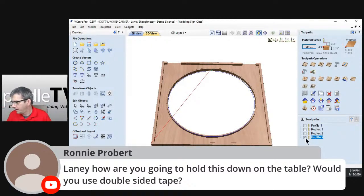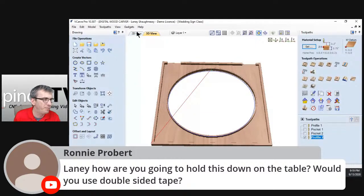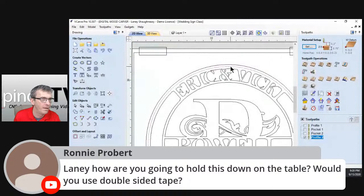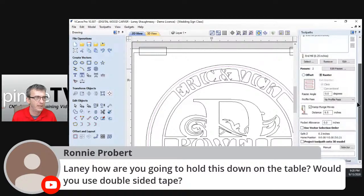And sorry about that. So let's really quickly regroup on that, because I said I wanted a contrasting background. So let's take that vector again, this inside vector, and make it a pocket cut instead of a profile cut. And let's go down. My material is going to be 1/4 inch. So I'll recess it in 1/4 inch. So we'll do that. Quarter inch end mill, calculate that,